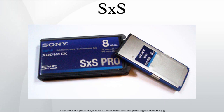The XAVC recording format can record 4K resolution at 60fps with 4:2:2 chroma subsampling at 600 Mbit/s. A 128 gigabyte SXS-PRO Plus media card can record up to 20 minutes of 4K resolution XAVC video at 60fps, up to 40 minutes of 4K resolution XAVC video at 30fps, and up to 120 minutes of 2K resolution XAVC video at 30fps.